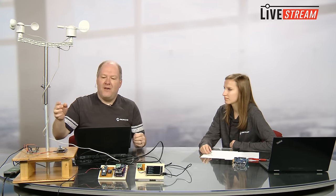I'm going to pick my previous discussion back up and continue on. One of the hardest things I had to do here was not getting the software together. The software fell together really quickly because of the excellent support from SparkFun and Adafruit and the open source community, which I've credited in my software, because I've leaned heavily on a lot of other people's work. The toughest thing I had to deal with, for those of you dealing with I2C sensors, is that some I2C sensors like 5 volts, most of them like 3.3. So most of my effort in this design is pushing 3.3 volts up to 5 or taking 5 volts down to 3.3. That's where I spent most of my time in this design, ironically.